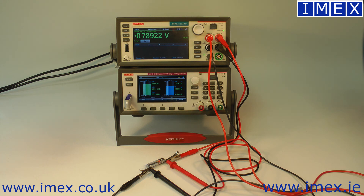If we were testing a particular device that had problems when the battery reached 1.3 volts, we can manually set our state of charge to constantly hold that and let us test and debug the problem. Thanks for watching, and if you'd like further information on either of these products, feel free to contact us or find a datasheet on our website imx.co.uk.